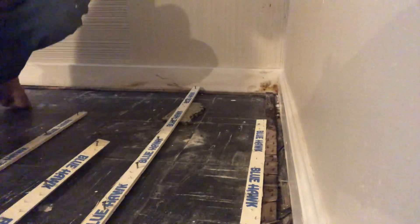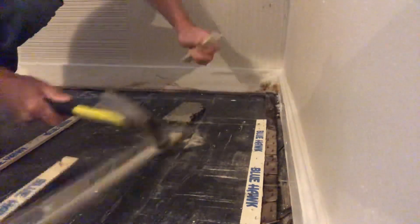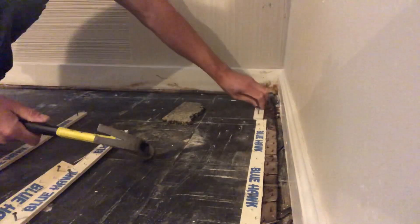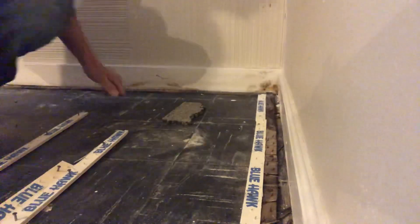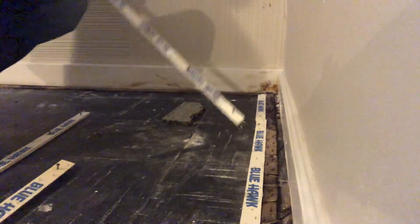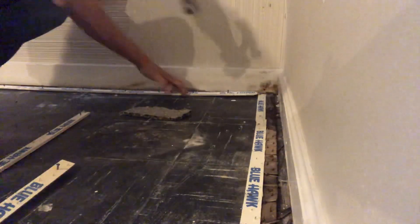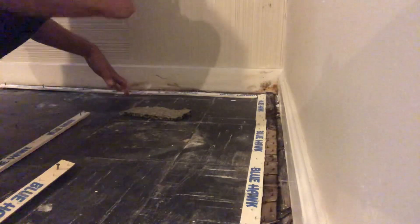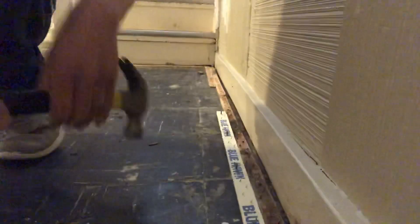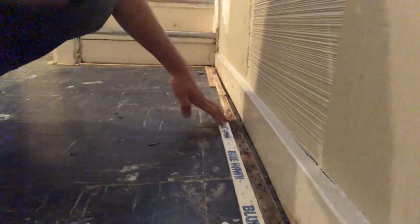If we are dealing with a regular concrete floor with no tile on top of it, then the 5-8 concrete nail is actually going to be your best bet in the vast majority of cases. It doesn't come standard on the tack strips you get at commercial joints — you have to get that at carpet supply stores, or you could probably order them on Amazon. At all the commercial joints you can pick up a box of 5-8 concrete nails — they've got a little carton for about $4. You can use those as your fill nails if the long nails are giving you problems going into the concrete.